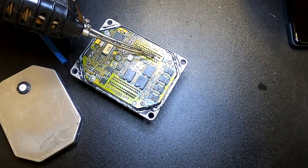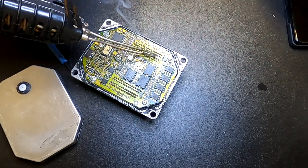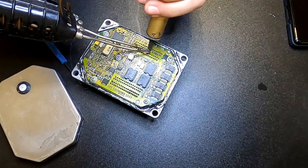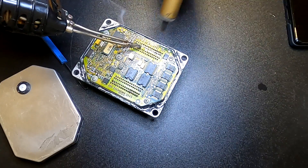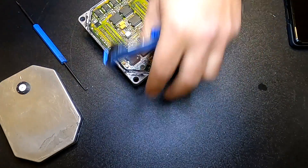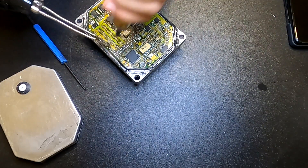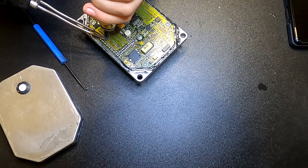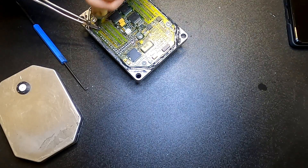Now I'm going to be removing the old solder where I see there is a lot of it, because this is no good. You can feel that there are pores in the solder itself — it shouldn't look like that. I'm going to remove as much as I can. I don't have to remove it all since it will melt together with my solder, but I'll remove most of it to leave place for brand new solder.